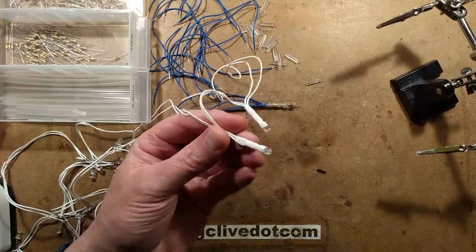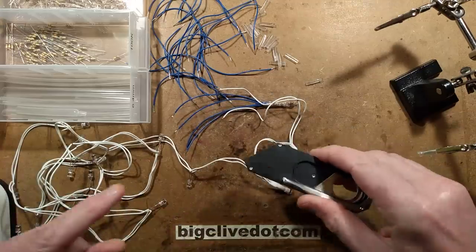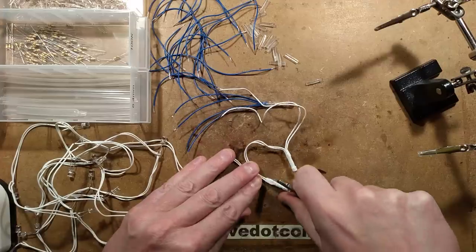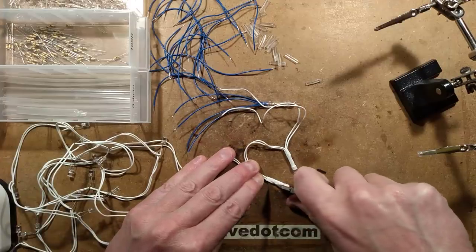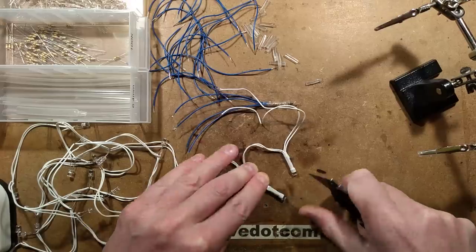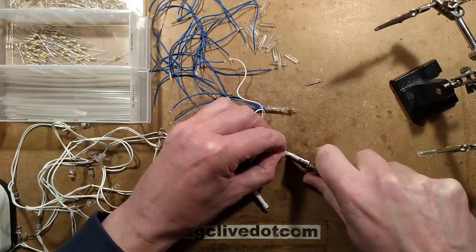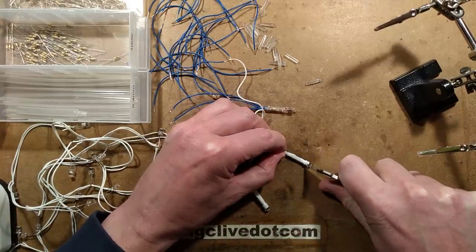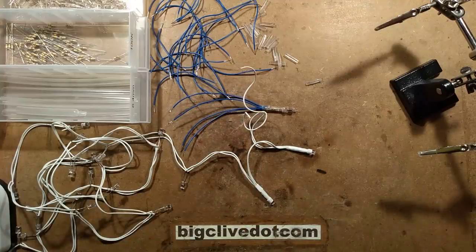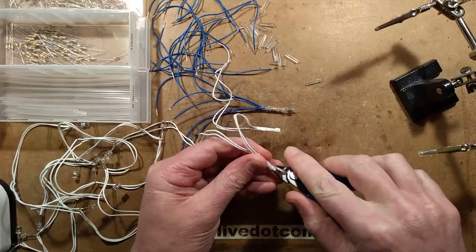Let's get a sharp blade. I've got a couple more LEDs in this string of lights. I want a sharp knife which I'm going to use to just slit gently the heat shrink sleeving around these low voltage standard parallel string of lights. I'm going to put a wee slit in the heat shrink, then retract the blade for safety, get a pair of snips, and cut that heat shrink off where I've split it.